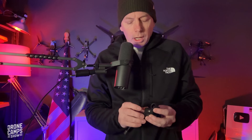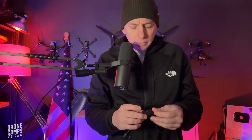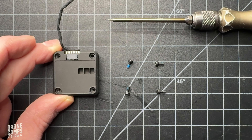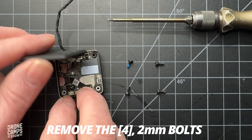There are people that have broken these and sent them back to DJI for replacement or repair, so that is totally up to your discretion. Without further ado, let's go ahead and jump over to the bench. I'll open this up and show you where the UFL connectors connect. We'll see if mine is floating or encased inside the solder, and I'll give you a few different stages of repair or strengthening you can do. Now, since at this point you're not worried about voiding your warranty and you are going to follow through with this, go ahead and grab a 2mm driver and remove the four screws on the bottom of the air unit pro.